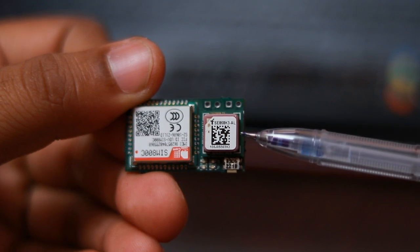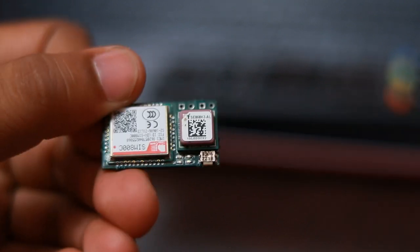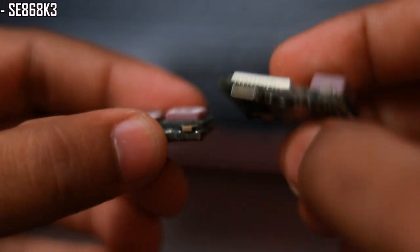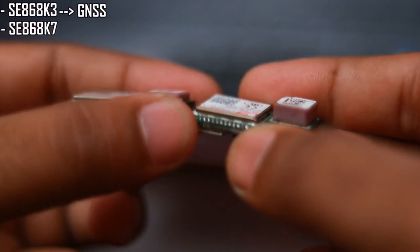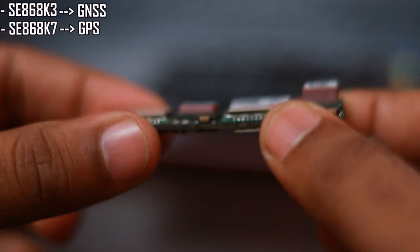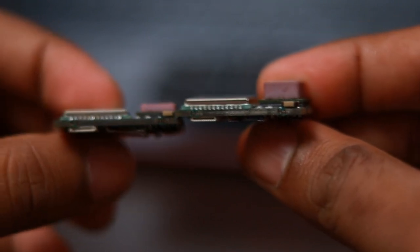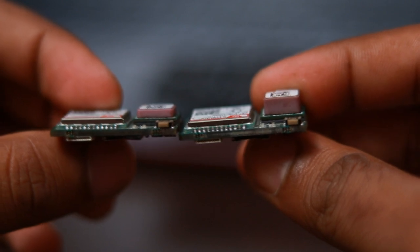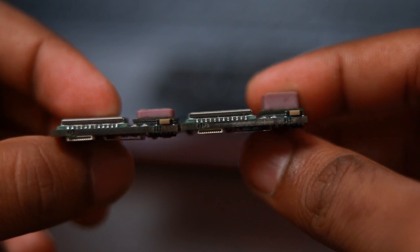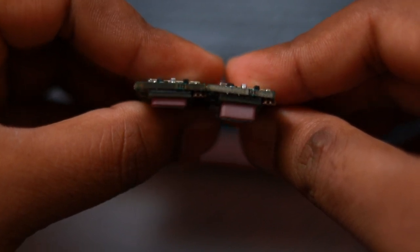The big change on the hardware is the GPS module, which has the major contribution to reducing the device size. It's the Telit SE868K3AL device. There are two variants of this module: SE868K3 and SE868K7. In size variants there are the SE868K3A series and the SE868K3AL series as used on these devices. The thinner one which you can see here is the K3AL series. The 'L' extension in the part naming indicates that it has a very thin patch antenna compared to the other part.